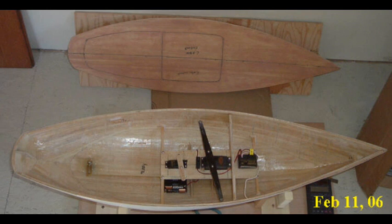There's also a white wire that starts at the radio receiver — that is the antenna. I didn't want the antenna visible from outside the boat, so I glued a piece of three-sixteenths inch diameter styrene tubing to the underside of the shear clamp in the hull. The shear clamp is a ledge just below the shear — the top of the hull — that the deck attaches to. The white antenna wire runs through that tube just below the shear, so unless the boat is heeled over and has buried its rail, it can always receive signal. So far it works really well with no problems at all.